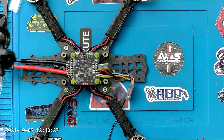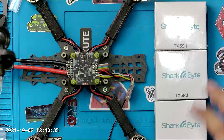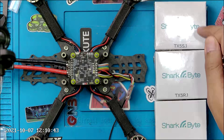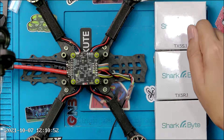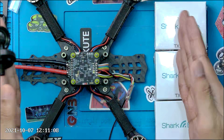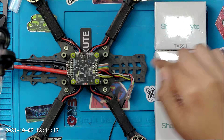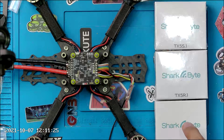Which VTX you choose for SharkByte really depends on the frame you have. You have three types: the 5S1, the 5R1, and the 5M1. The top two most easily found are the 5S and the 5R — S is for sport, R is for race, M is for mega, I have no idea. The 5S and 5R are 25mm and 20mm mount respectively at 200mW, and the 5M is a double-stack 500mW. The choice isn't just about power; it's about what frame you're using. Race frame, go with the 5R. Whoop, go with the 5S. Freestyle build where you want more penetration with 500mW and have the space — you'll need the 5M.